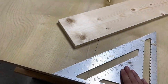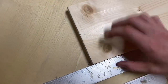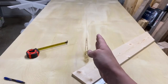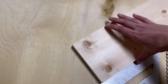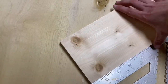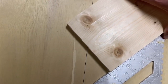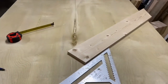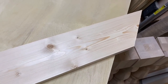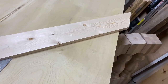Using a square, a lot of people think that you line up the corner with the center point, but if you do that it's going to make your herringbone off a little bit. What you want to do to get it centered is center the line with that center point, not the corners. We're going to move that up until it is in line — that is where our first piece is going to go. I leave a little bit of a ledge there, because it's better to have to cut off than cut it too short.